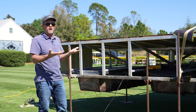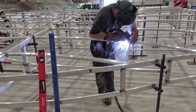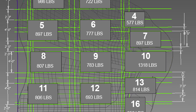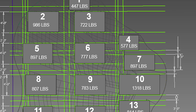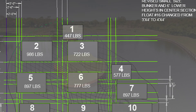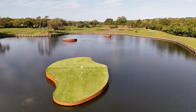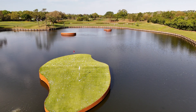It really comes down to the frame — you want everything pushing at the right amount so that there's balance and equilibrium on the pressure to the frame. We design the frame with all the floats in place in virtual space, and then it's placed into a virtual body of water. The software measures how much load is on each float location, which tells us how much weight is there. We then interpret that data into how much buoyancy each float can provide and determine what depth to place it at.